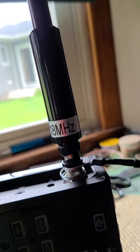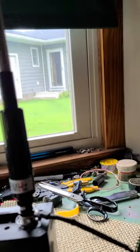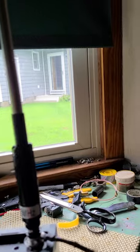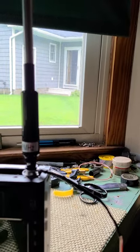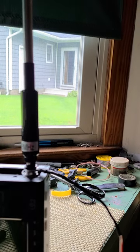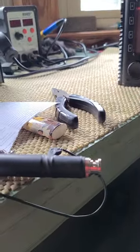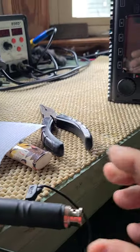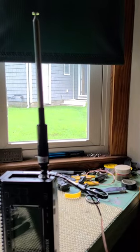I got a good idea off YouTube where a gentleman had a spring kit and put a spring load on the bottom of the antenna to pinch the lead on there tight, and it works. The antenna fits on the BNC firmly when you're holding it — it doesn't bobble and wobble. The MFJ 1899 has a lot of play in it, it's real long and wobbly feeling. This feels good.